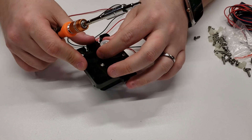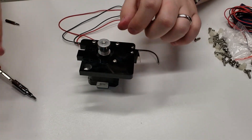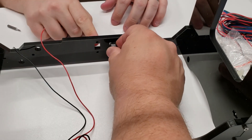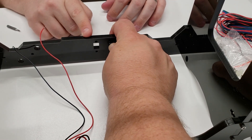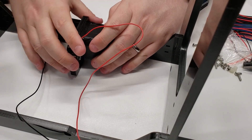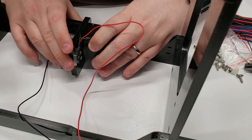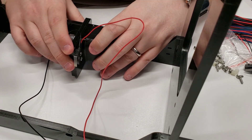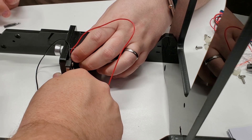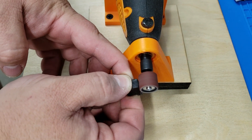The motor assembly went together pretty easily — we got the motors attached to the acrylic plate without much trouble. However, the spacer they wanted us to place was actually a bit too big. When you put the motor into place, it would wiggle left and right. This was surprisingly not the first problem we had. The fix was simply to grind it down on the Dremel tool.